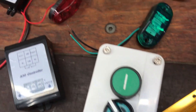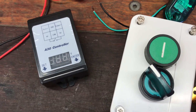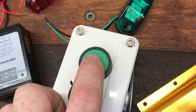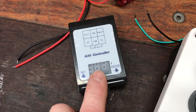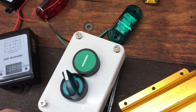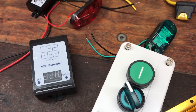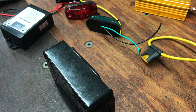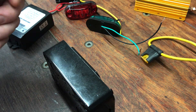To operate the pre-charge circuit, we'll turn this switch on, which will bring on the red indicator and there'll be zero volts on the controller on the capacitor load side. Then we'll press the pre-charge button — the 52 volt threshold will be met here, switching the relay and bringing on the green LED. Then the DC breakers to your battery and inverters can be switched without the massive arc and huge current inrush. The first thing I'll do is mark out the cable penetration and the mounting holes for these indicators.